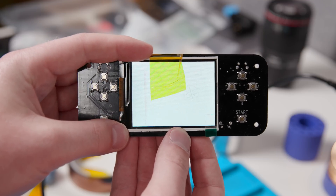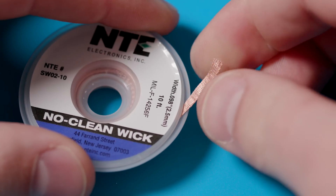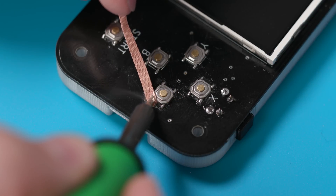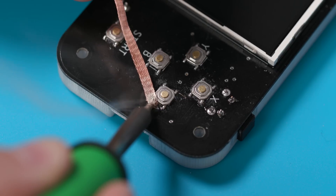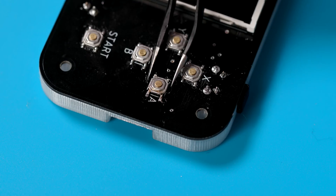Then save the document, eject the SD card from your computer, put it back into the Raspberry Pi Zero, and turn the switch on to see if it boots. If it didn't boot up or some of the buttons don't work, that's okay — the great thing about soldering is that it's not permanent. Just undo the soldering on the buttons and try again. The best way to remove solder is using solder wick, which is very cheap. Put a little flux on the end of your wick, place the wick on top of the solder joint, then place the soldering iron on top of the wick, and the wick magically sucks up all the solder, making it easy to remove your buttons, reposition them, and try again.